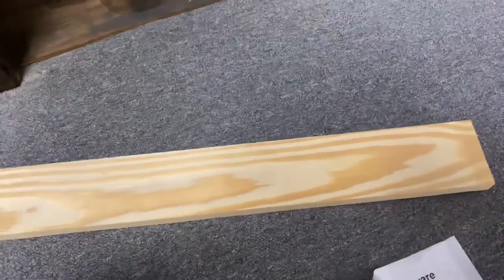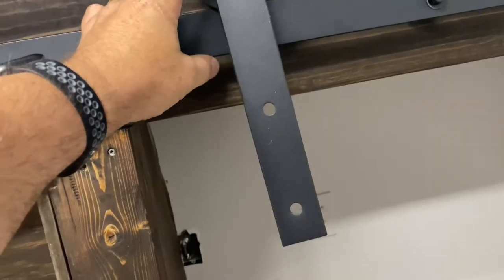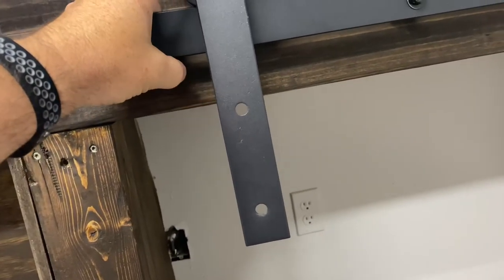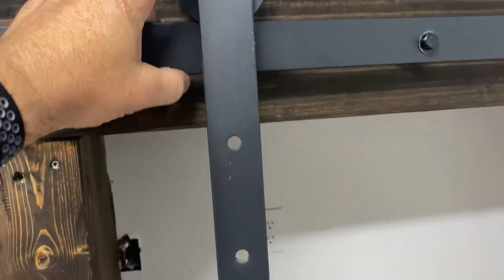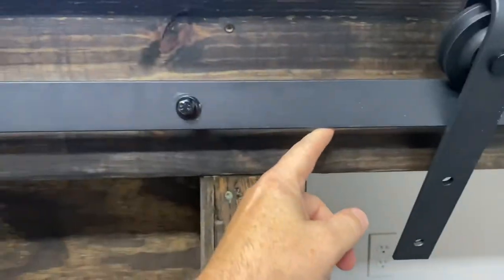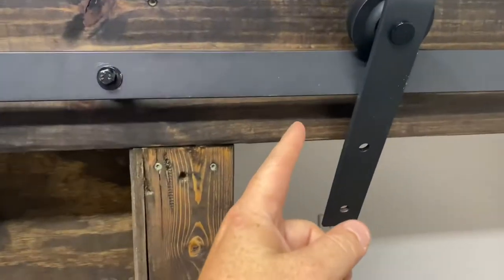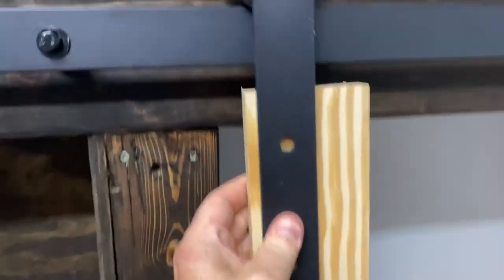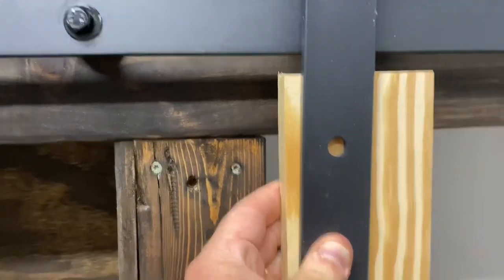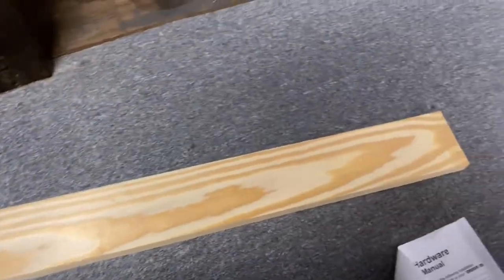I've gone ahead and cut one board just to measure and confirm sizing before committing to the whole door, because we're going to be about 15 boards wide using 1x4s — yellow pine that we're going to stain. From the bottom of the rail to the hole is about 2 inches, and I want about a half inch between the top of the door and the bottom of the rail. From here to the floor is 30 inches, so I'm at 29 and a half, but I don't want it sitting on the floor, so I'm taking a quarter inch off — cutting these at 29 and a quarter. I brought it in and held it behind just like I would when installing it, and there's just enough space at the bottom. So 29 and a quarter it is.